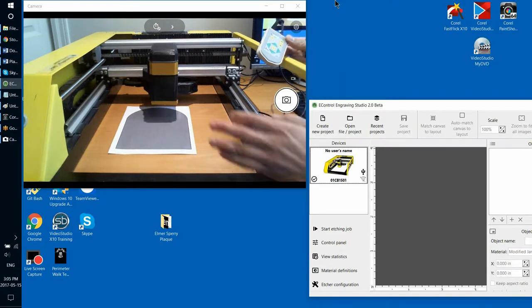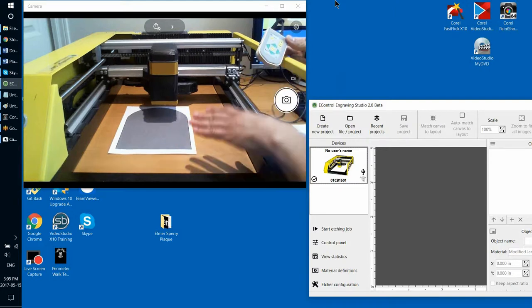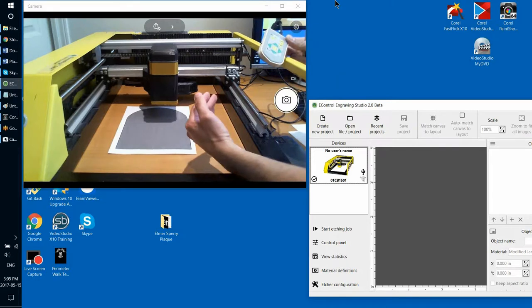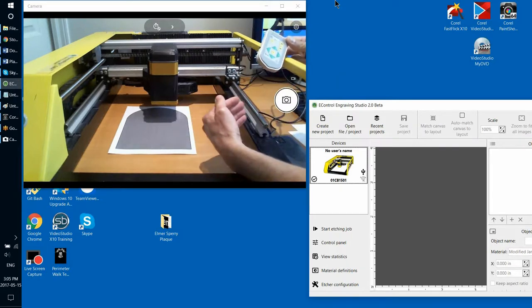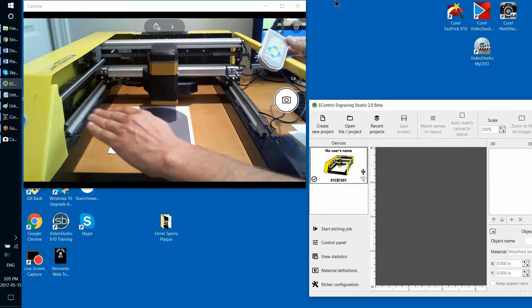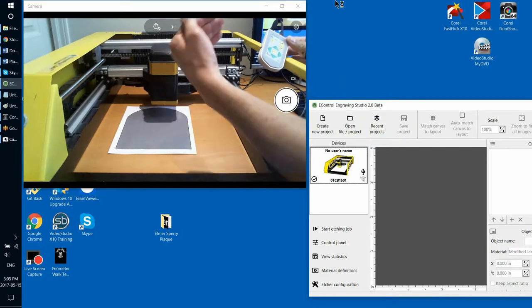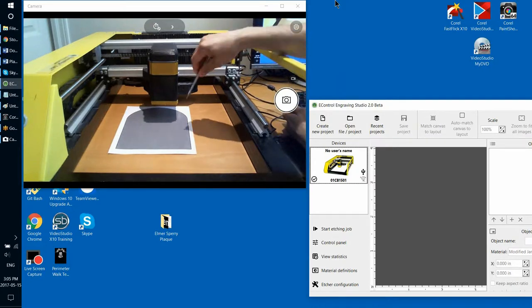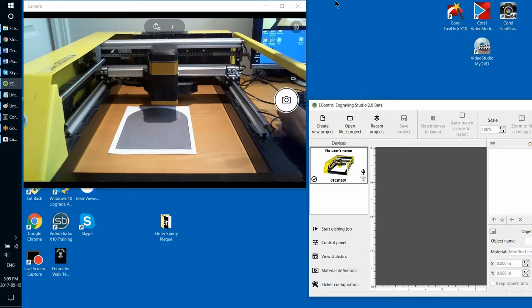In your production situation, the compact machine is designed to be put directly on top of the stone. So right where you see my table, my desk, that's the surface of the stone in a typical production use of the compact machine. If you do use one of our stationary machines, then the stone is fed in between the legs of the machine. You just feed it in underneath, and you just lower the etching head to the stone surface. So positioning the stone versus the control range of the engraving head movement is very important.